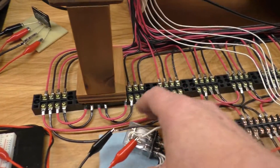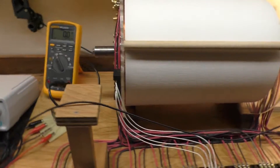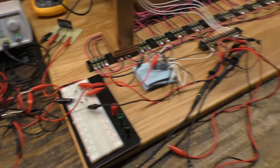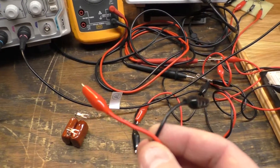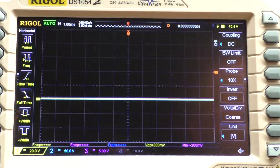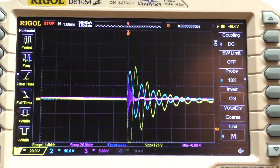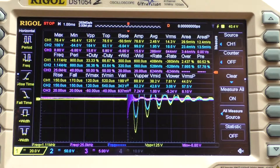I've got the solid-state relay turning on and off the mechanical relay. On this end I have the small coil sitting there, and a piece of wood to keep the coaxial cable out of the way. I've got extension leads on the end of the coil to dump voltage back into the coil from the capacitor, and separate leads to charge the capacitor. Turning the coil on at 10% duty cycle — I'm measuring 125 volts on the primary, 164 on the secondaries, and 15.6 volts out of that small end coil.